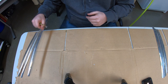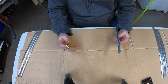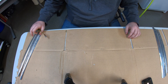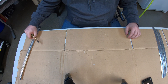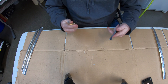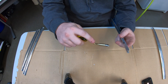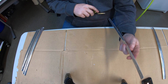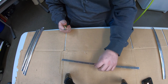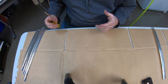Here's a tip I like to use during repetitive motions in this process, because it's real easy to forget what you have and haven't done yet. I've got all my stiffeners for the right-hand side of the rudder grouped together over here, and the left-hand stiffeners grouped together in a nice order. Because it's such a repetitive motion, you want to stick with the same pattern as you deburr — I go all the way down the bottom of the stiffener, then come to the top, going from top to bottom, and then set it aside and work my way through.